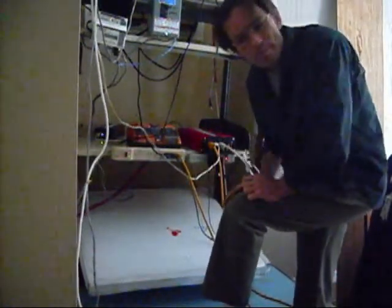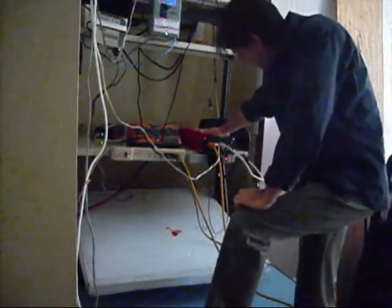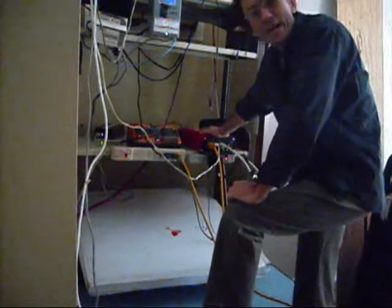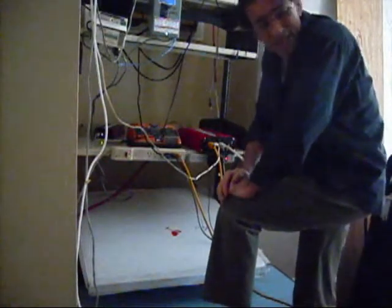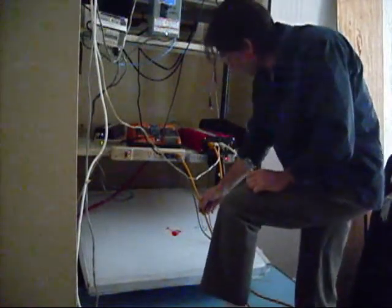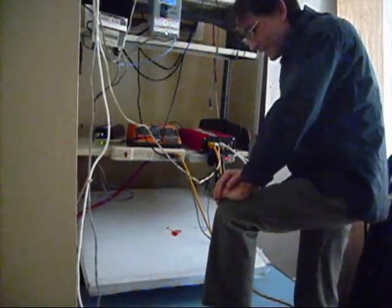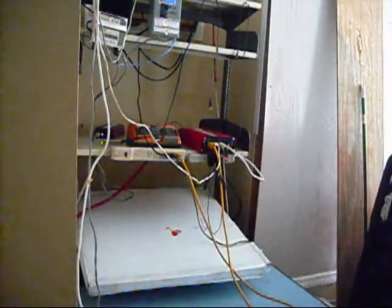The lights in the front room are twelve volts — that's the only thing running on this one. This one here stays on twenty-four hours a day and runs my Verizon router box — not the router itself but the unit — and it draws so much electricity, 20 watts an hour, which is bad. So the refrigerator's coming off for now until I figure something out. I might go to a 48-volt inverter and just change my whole setup. I keep this little trickle charger on here to make sure I never go too low — oh, I've got a customer, so I might have to cut this short.